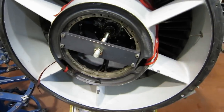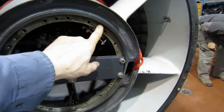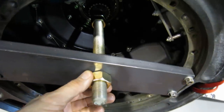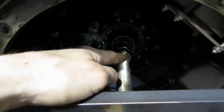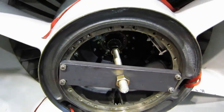When you're dealing with an engine that's on the vertical build stand and you're going to remove or install the thrust bearing, you've already got a rotor jack installed. Here's a rotor jack that I built last week, shown in the Arenda turbojet. There's a bolt circle that holds a plate on the front of the engine — you just fabricate this plate, weld a nut to it, and use a threaded rod that pushes against the front of the compressor rotor. That keeps the compressor from falling out or falling forward and crunching into bits of the engine when you remove the thrust bearing.